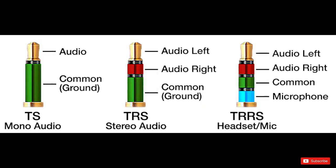Now, before I show you exactly what kind of adapters and connectors you need to get in order to make this possible, I think it's very important that you understand why we need to do this in the first place. So when it comes to your standard input jack, there's generally three different kinds that we use most of the time. There's a TS, a TRS, and a TRRS. The T stands for tip, the R stands for ring, and the S stands for sleeve. Basically, all that this is is how many different connections your cable is going to be able to make.